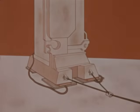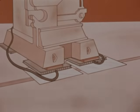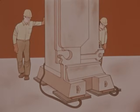A small amount of water poured around the casters will bubble when free float is established. When using air casters, friction between the floor and the casters is so low that a floating load will float downhill on a slight grade. Restrain loads for positive control with common rigging methods. To move loads over cracks that cannot be permanently filled, such as sliding door tracks, floor joints, or elevator gaps, thin-gauge metal or unembossed linoleum can be used to prevent loss of air under the casters. On a level floor, the amount of push needed to move a floating load will be roughly one one-thousandth of its weight. For example, a three-thousand pound load on an air film will move with a force of three pounds or less.